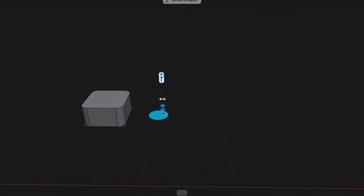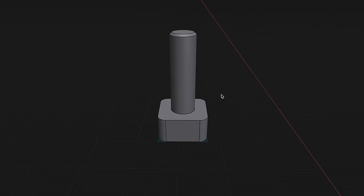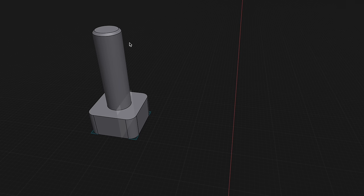A lot of times you're just not going to be able to find a 3D model of something that you're going to want to include in your design, so this is the point where a really good pair of calipers does the trick. Now, when you're measuring something like this, take the same approach as you do in your design. Measure the large blocks first. Measure the major shapes first. Is it a square? Is it a rectangle? How thick is it? How wide is it? Then get into the details. What's the radius of the corner? Are there cutouts? Are there threads?